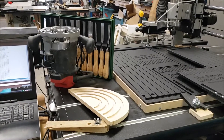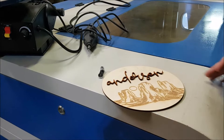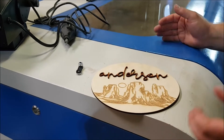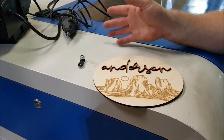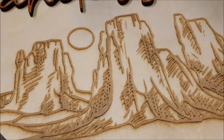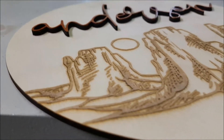The way a laser works: it uses a concentrated beam of light to cut through material, so it's a little bit limited by how thick of material you can cut through. That right there is eighth-inch Baltic birch. The real limit of this machine — which is about 90 watts — is a little over quarter inch, so quarter inch comfortably. And then you've got the engraving, which is the other really cool aspect. To engrave, it's basically just a reduction of the power of the laser beam.